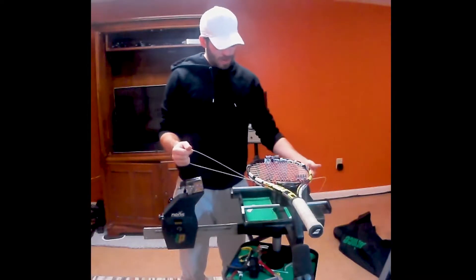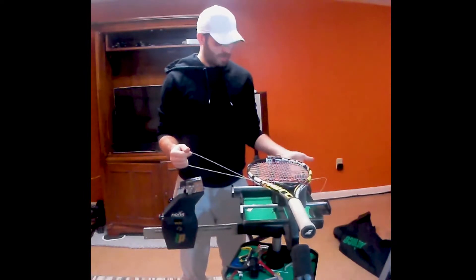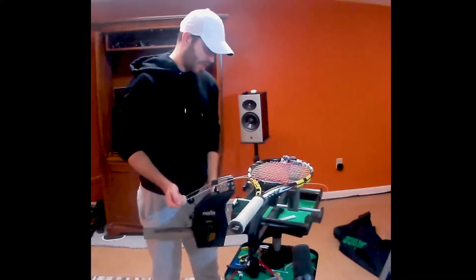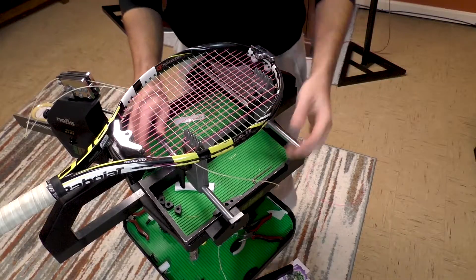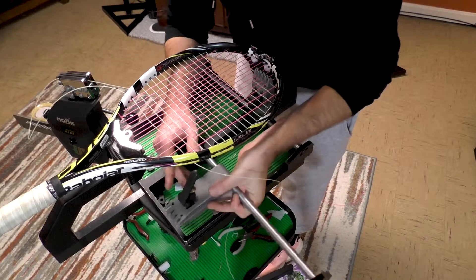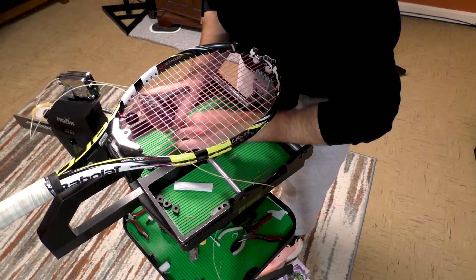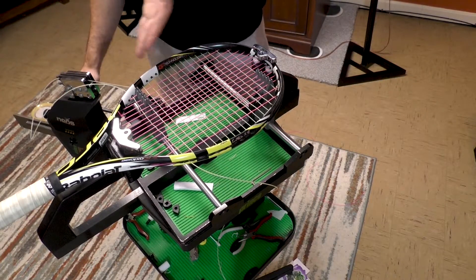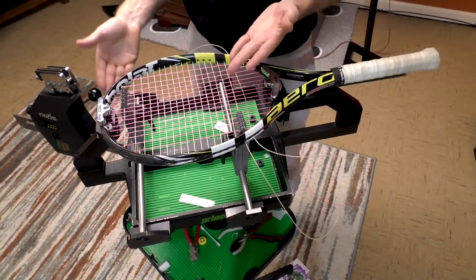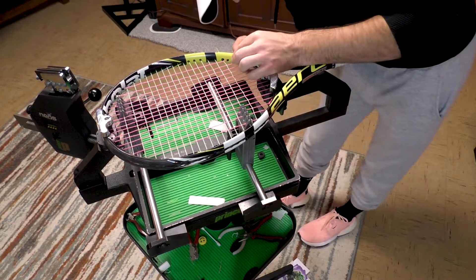Welcome back. We are getting to a point now where I have to flip the direction of the drawbar. For you guys who've watched my videos in the past, I always do that from the top for some reason. Now that we have a clamp that's already in there, we're going to flip it around going through the bottom — bring it out through the bottom and then turn it like so. So that's kind of the final stage of using this starting clamp method when there's a drawbar there. And we're actually already now to our final cross here.